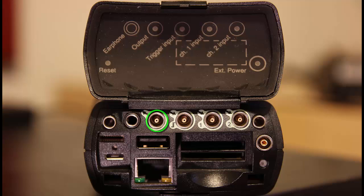The next connector is the output connector. It can be used with the internal generator on the meter, as an output of the microphone or accelerometer signal, or as a DC voltage that is proportional to the input level.